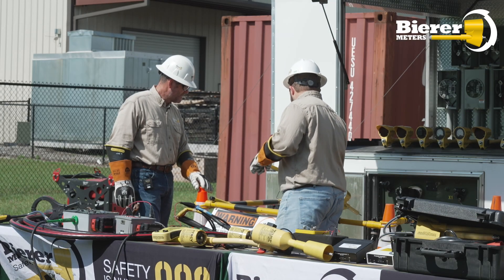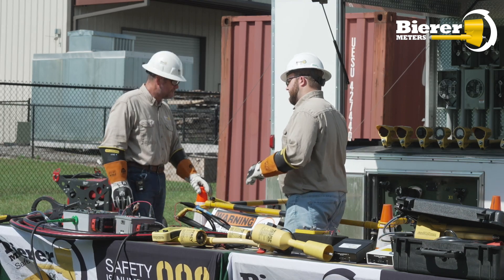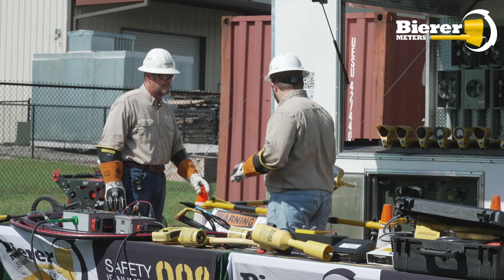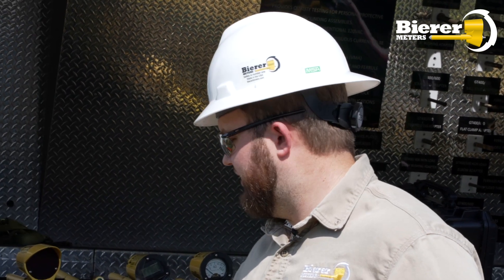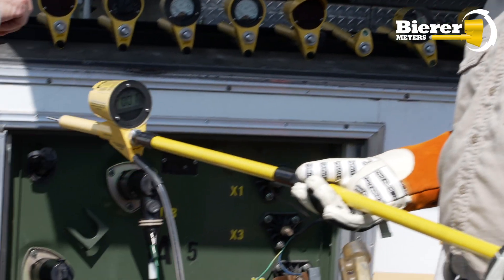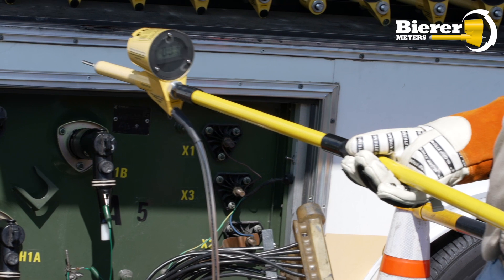So the first thing we're going to do is take phase-to-ground measurements. The reason we're going to do that — a couple of different reasons: we're going to verify first that the tool's working and that what we are testing is energized. The second reason is because you're going to need that information later on. Also, we're verifying that our head's in the game, like Brent spoke about earlier. So there are actually three reasons.